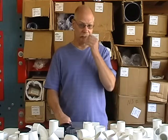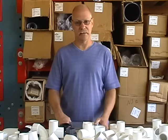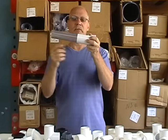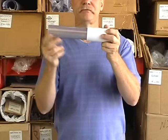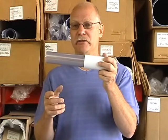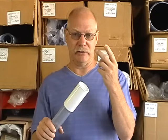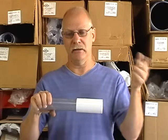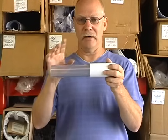Here's the situation: you've got irrigation, a hot tub, something dripping, and you've tried slapping some glue or silicone on it — that doesn't work. If you put anything other than PVC glue on the joint, your only solution is to cut it out. If you put silicone on it, forget it, this trick is not going to work. But if you just found a leak and haven't attempted to fix it, I'm going to show you how. This represents pipe into a fitting. The leak is typically along this joint. If it's spraying out this system probably won't work, but if it's a drip or a fast drip, it likely will. You've got two situations: suction line or pressure line — gravity is the same as suction.